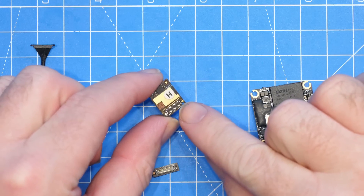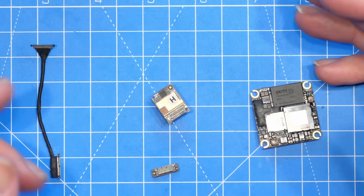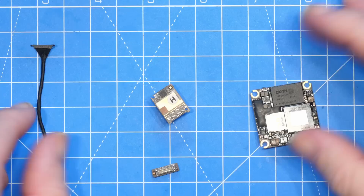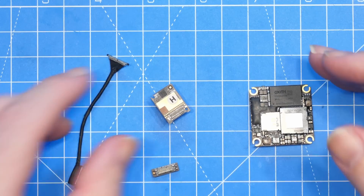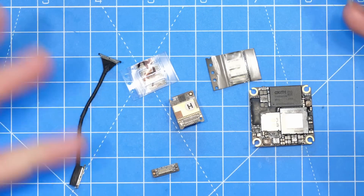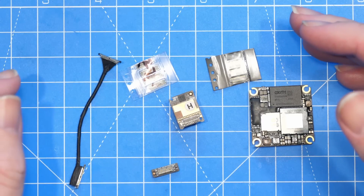I've already removed the connector off the camera. I didn't do that on film. However, in some of the moving around on the bench, some of the pins on the connector actually broke — you could see it actually moving — and as a result it would no longer connect. I've spent some time digging around and I believe I've found replacement connectors which I've bought off AliExpress for a couple of dollars, and that's what we're going to do today.